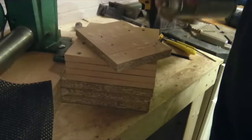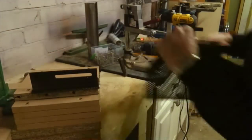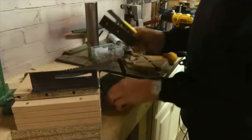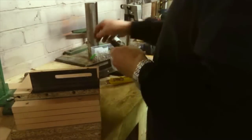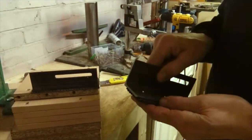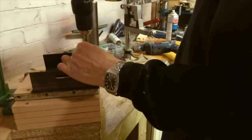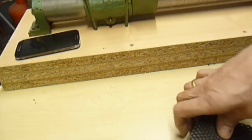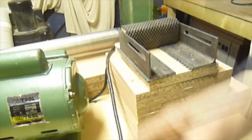I'm making quite a thick pedestal to take the vibration out of the motor, and I'm also going to isolate the motor on some rubber matting. I'm using a couple of handmade screw-down knobs and a couple of coach bolts, and I'm also putting in a block of wood wrapped with matting just to take the vibration out of the front.